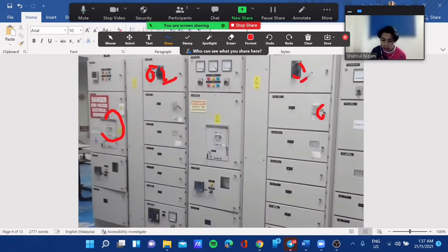Both interlocks isolated are now free to be switched on, thus completing the bus bar coupling operation. The respective bus bar supply indicator lamps will indicate that the respective panel keys are energized by the other panels.